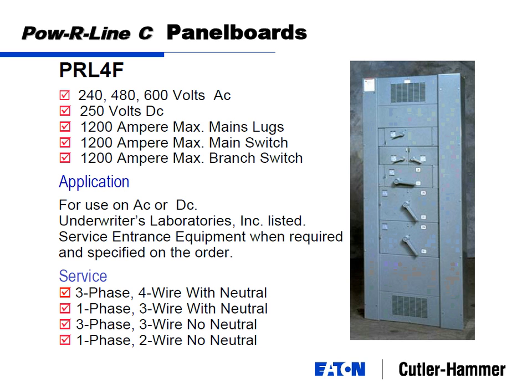And if you've got a switchboard, for example, well, let's just look at this panel board example. There's 1, 2, 3, 4, 5, 6, there's 6 feeder devices into this fusible switch panel board. And it's pretty close to full with 6 feeder devices. I can put 18 circuit breaker feeder devices in this same footprint. Versus 6 in a fusible.